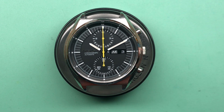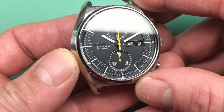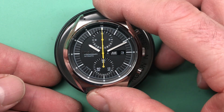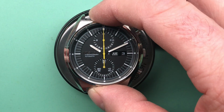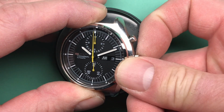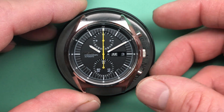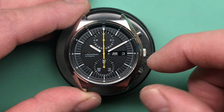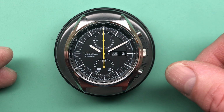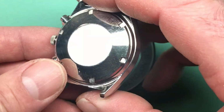But the mysteries weren't all just that. You know, you had some incorrect parts, you had some missing parts, you had some broken parts. Overall the watch is gorgeous. I mean, the condition is superb. The movement itself had some serious needs. Unfortunately, there was some extra time in getting your hairspring straightened out. Also, had some extra parts. You had a couple incorrect screws, so there's one of them I had to replace, and it's a somewhat special screw that goes into the winding bridge. You had a missing clip for your day wheel, which may be somehow related to the fact that things got broken and then looked at, but I'm not sure. Yeah, just missing and odd parts in weird places.